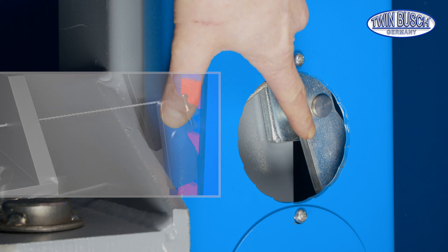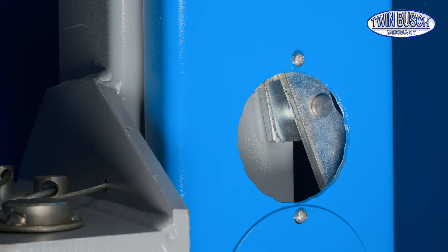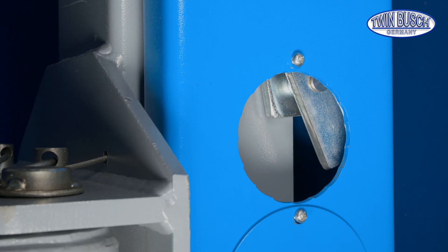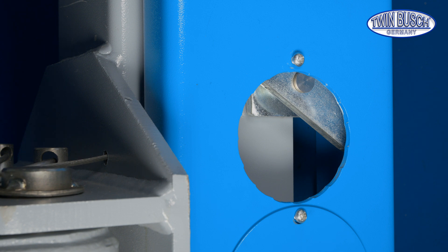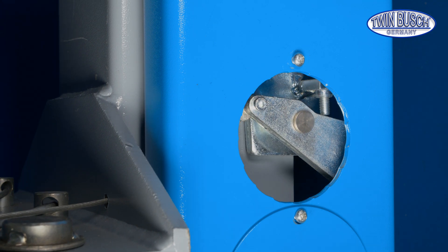In this case, the catch folds back into the locked position because the rotary latch doesn't keep the catch open when lowering. Now we drive up a bit, release, keep pulling the cable, and lower into a position in which the adjustment screw is accessible.